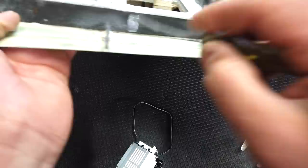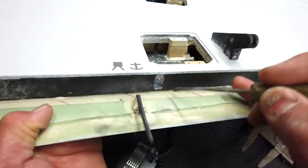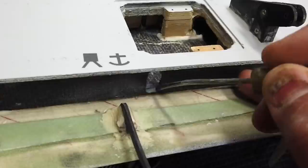I've put the initial hole in for the control surface rod — took the line, transferred it down here, and just used my Dremel to open that up. Just as a point: this is a carbon overlay of foam with carbon on the other side, so it's a laminated piece — kind of neat, but actually really easy to get through.